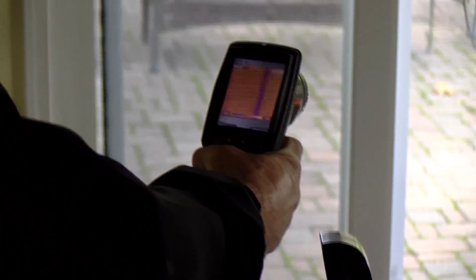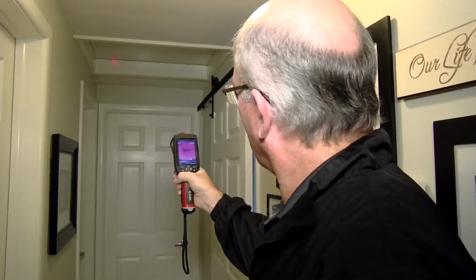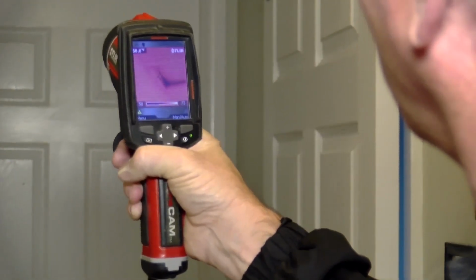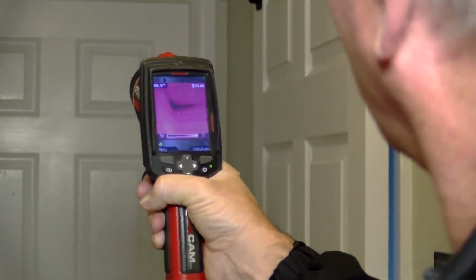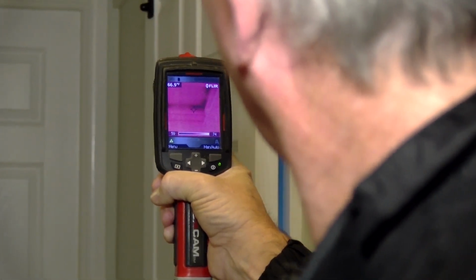After we've insulated the attic, you've sealed all the crevices and the cracks in the basement and around the house, the next place for the heat to escape is your walls. If your walls are not insulated or insulated very poorly, you're losing a lot of heat out of those surfaces. Plus, the wall surface temperature is so cold that it makes you uncomfortable in the house, even when the temperature is 70+ degrees in the house.